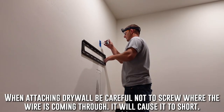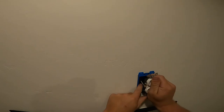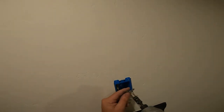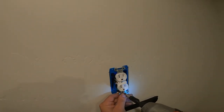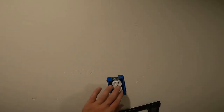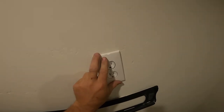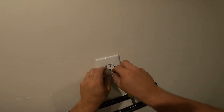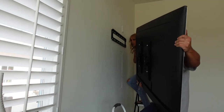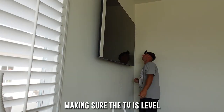This is kind of an art — you want to fold the wires down and fold them back in so that when the outlet goes in, it goes in nice and smooth without fighting it and without the wires touching each other. If your black touches your ground or neutral, you have a short and a problem. Put the cover on and restore power.